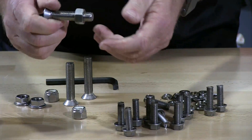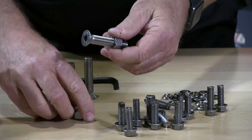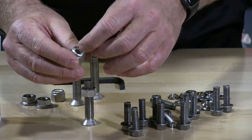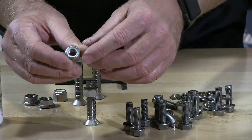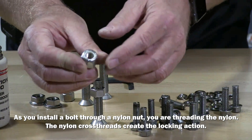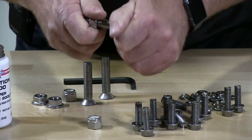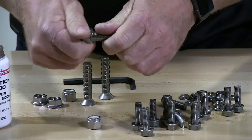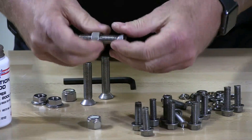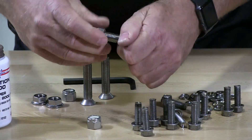What happens is the two different cut threads start to heat up as you're turning it on. This is a regular finish nut. If you use a nylon locking nut, a nylon has a nylon cap integrated into the nut, and that nylon creates substantial friction which creates heat. At the same time, it accumulates the debris inside the threads and the high points. Then your nut will lock up and you won't be able to turn it all the way on. By moving this up and down, I get points where it starts to stop and jam up.